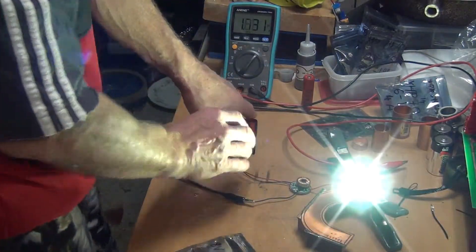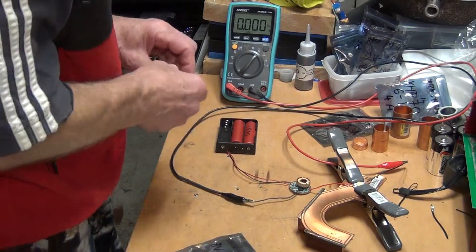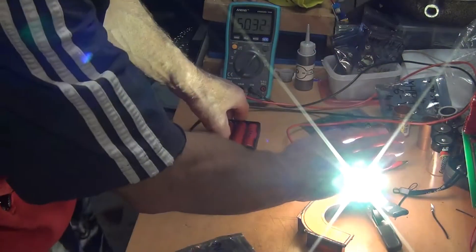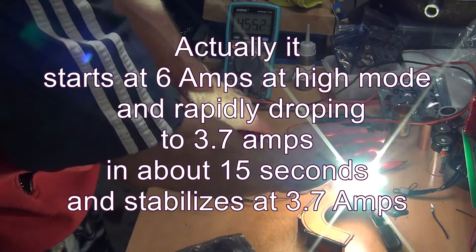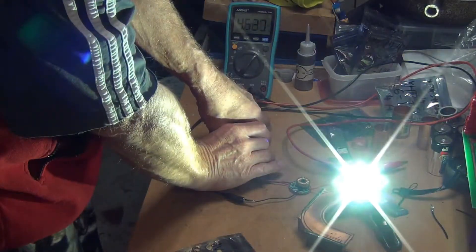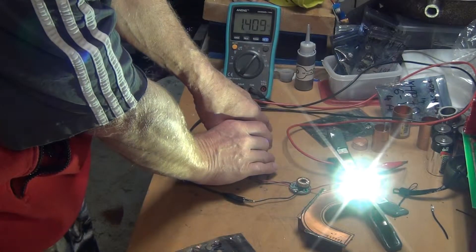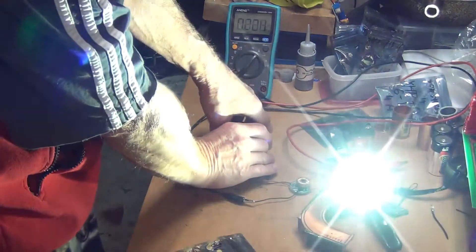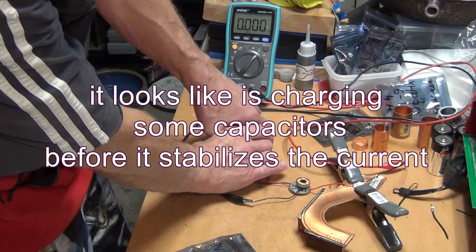The amps are not good though — only 1.6 amps. Let's get this thing out and try the 12 volt supply. At 12 volts it's coming down, which is kind of strange. I cannot switch modes fast enough, but it's 1.4 and 0.2, then I go back to high — 5 amps. So this is overdriving the LED a little bit and it's starting to smoke, so I got to shut it off.